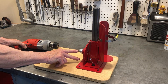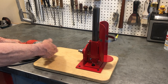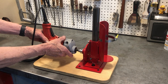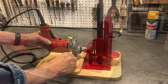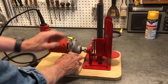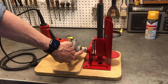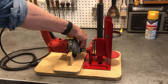This is tapped to 3/8-24 thread, and I'm going to take this chuck off and use this threaded shaft, so I need to come up with something that I can support this drill while it drives this accessory. For my drill mount, I put a piece of leftover carpet here to cushion the drill, and then this is just a thumb screw hose clamp and it holds it really well. Then I've threaded it into this shaft here with the 3/8-24 stud that came out of my drill.